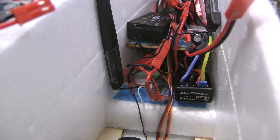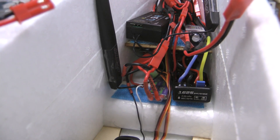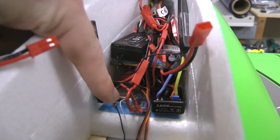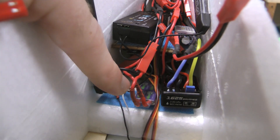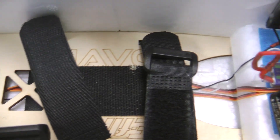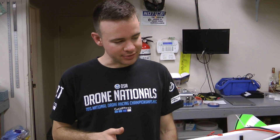I'm using an ESC instead of a switch so that we can have variable brightness. One more item in here is a Turnigy remote switch — 30 volt, 10 amp — that drives the nose light on and off. Its behavior turning on, off, and delaying with the landing gear is all just mixing inside the Taranis. I'm also running the FRSky L9R, one of my favorite receivers. It's a 2.4 gigahertz receiver that's longer range — you do lose telemetry — but pack voltage comes directly through the OSD in the camera.